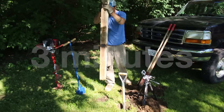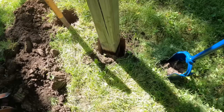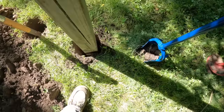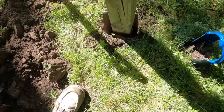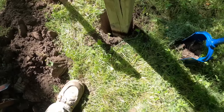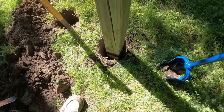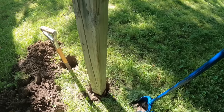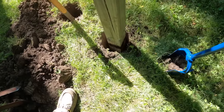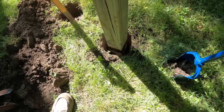Post two going in. Extreme close-up on post number two — this one ended up a little bit deeper, I just went a little too far. You can see it's also got a pretty good amount of room around it, a couple inches on either side. It looks like I put this hole in a little bit uneven. One of the things you can do with a post hole digger is kind of go around the hole in circles to get a straighter hole. But otherwise, not too bad — especially if you like a tight fit and not too much concrete.